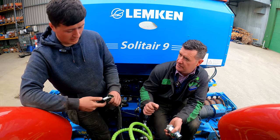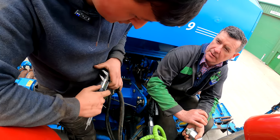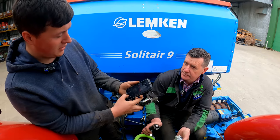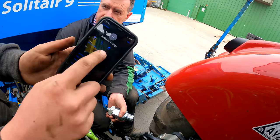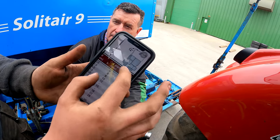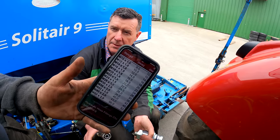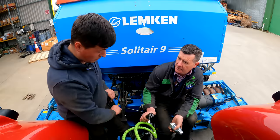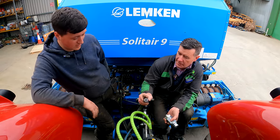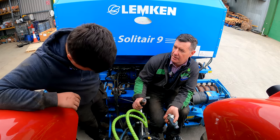How do you measure that? I was able to put my calipers onto the inside and measure the inside of the threads — it was running at 20.5mm. I have a hydraulic fittings chart saved as a contact on my phone, which is always a very handy thing to do. I can search hydraulic fittings and have all the fittings listed with inner diameters — M22 has an inner diameter of 20.5mm, so that's how I confirmed it was an M22 thread. I did the same thing for the outer threads on the BSP, though I generally know by sight what size is which. For a lot of people who might not know, that's the method to confirm it.